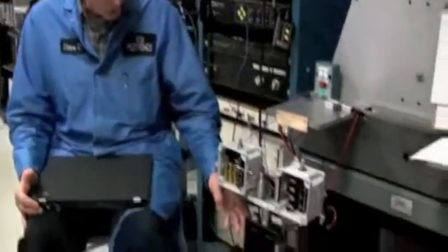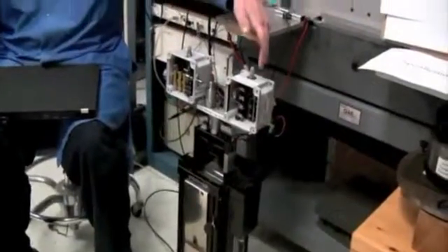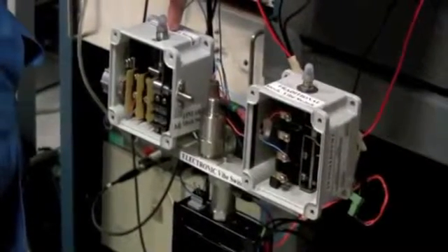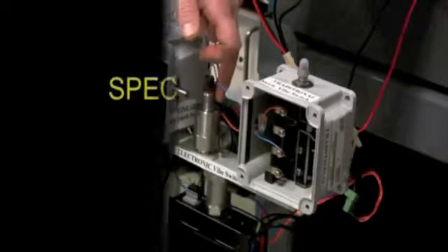This is the long stroke shaker. It has the capacity to go about six, or a little more than six inches. The three switches are a traditional mechanical vibration switch, a new linear adjusting mechanical vibration switch, and an electronic vibration switch.